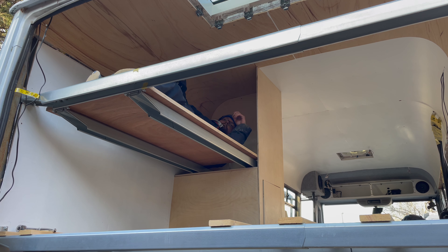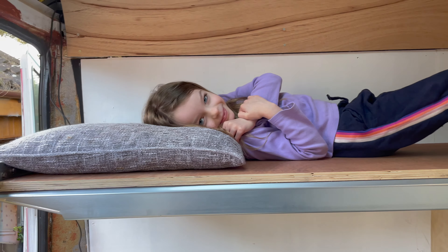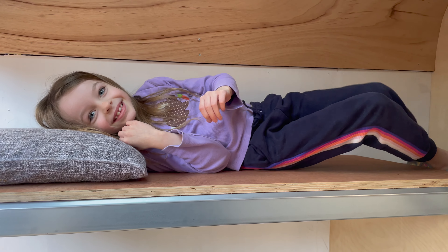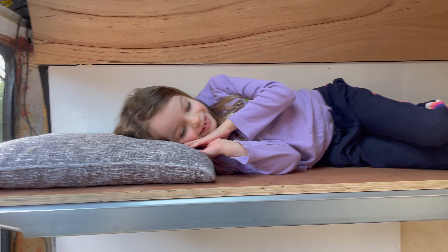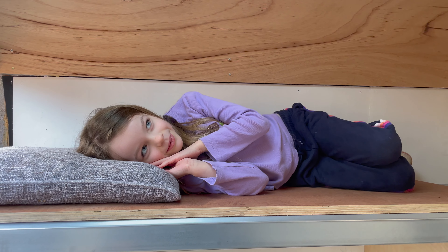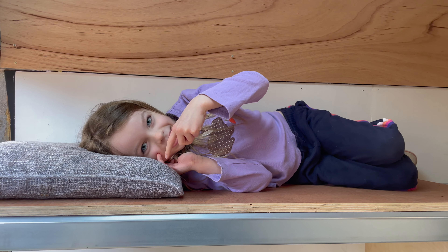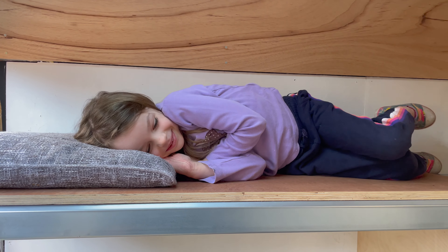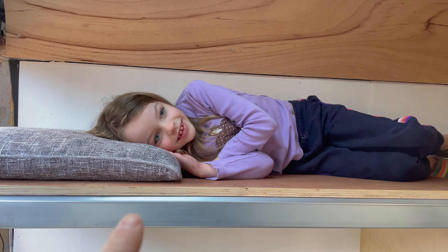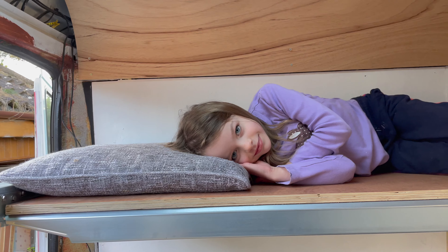Saturday afternoon, it's fairly warm, so I've taken the chance to get out here and do a little bit of varnishing, because we want to make sure everything is protected. We're using diamond hard floor varnish — we've proven that once it dries, you can barely see it's there, which is good because you want to see the grain of it. When we come to the kitchen, we might use Osmo Oil, we'll give that a go. Varnishing is really boring in terms of viewership, which brings me on to my next point: as we move into parts of the build which are a bit more boring or are going to take a few weeks, we won't show this stuff in so much detail, so our schedule of going out might reduce.